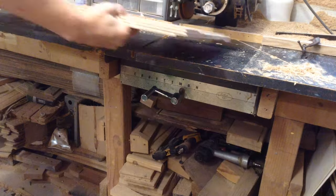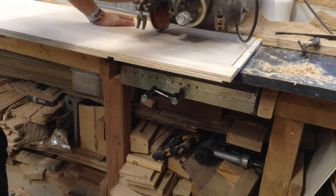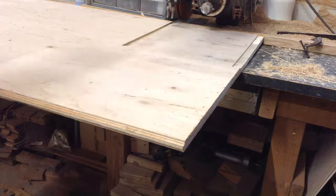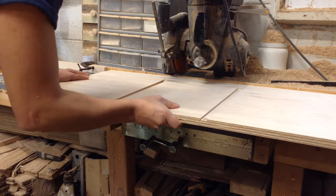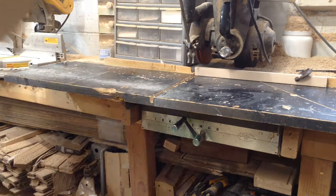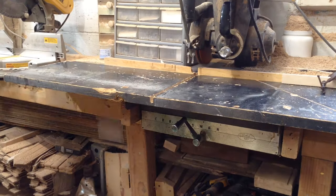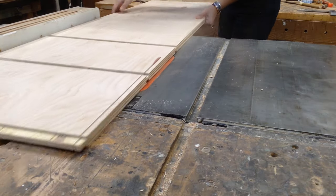I like to go halfway through this three-quarter inch ply, so three-eighths inch dados, but you can't do that with the middle panels because that means you'll cut through the whole piece. So what I did was quarter inch dados — I have everything set up the same way and then I just lower the blade, the groove is already there, so I just have to make those side panels thicker. It was a little longer of a process but the important part when doing rabbets and dados is that they're all oriented symmetrically and the same.